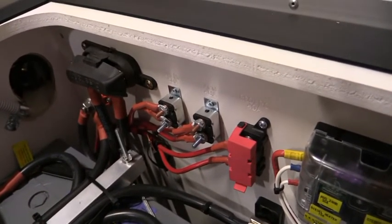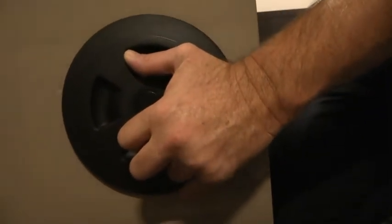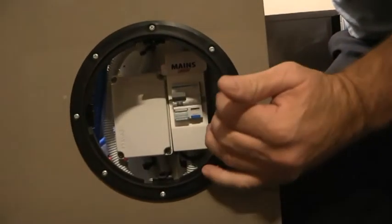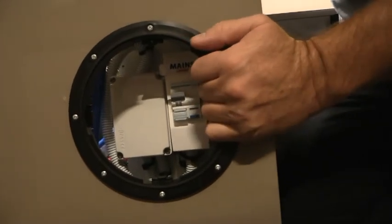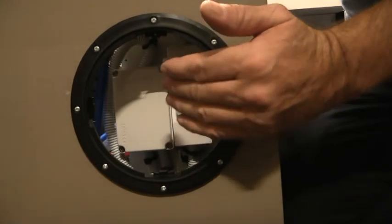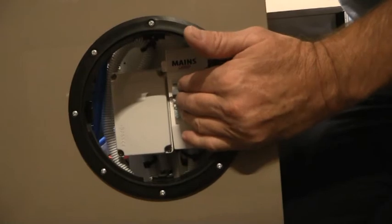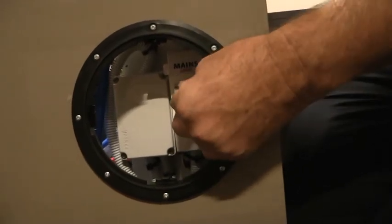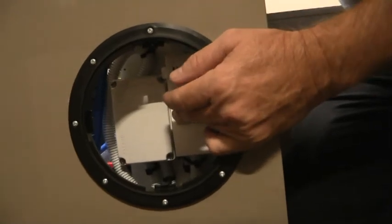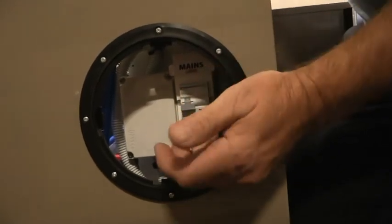Here is the spinner cap located inside the cabinet underneath the dinette setting. By undoing and removing the cap, we're exposing the RCDs - commonly known as safety switches, the same setup as what you have in your house. This is to protect ourselves and the unit when we plug in 240 volt, whether from mains power or generator. These are very sensitive to any change in voltage - a dramatic quick change will automatically flick them off from that position very quickly.